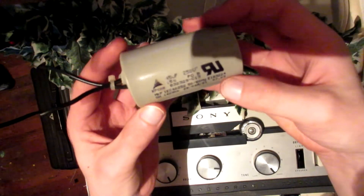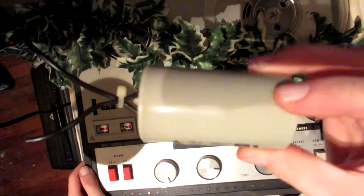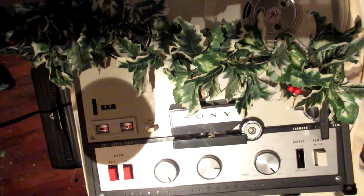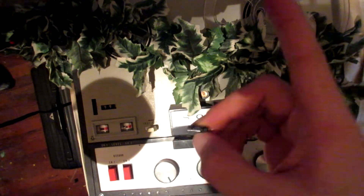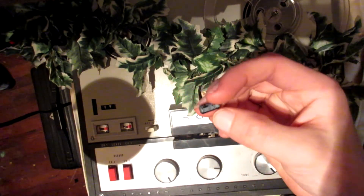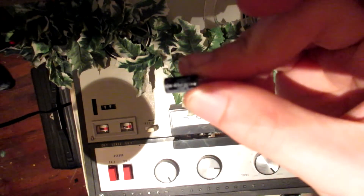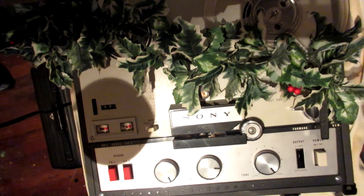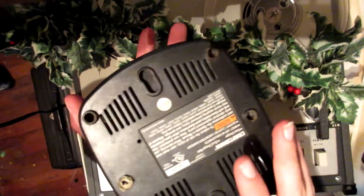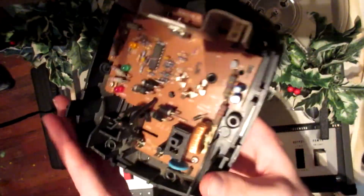We're going to put this in and replace the 50UF with a 45UF. Actually, no, that will not work. They no longer make 50UF and I can't find any on eBay — that's actually where I get my capacitors. So you replace a 50 with a 47; it's set to work and I'm pretty sure it will. I only got one 47UF, I need another one. So I take apart that old battery charger and see if it has a 47 — it has two 47s.